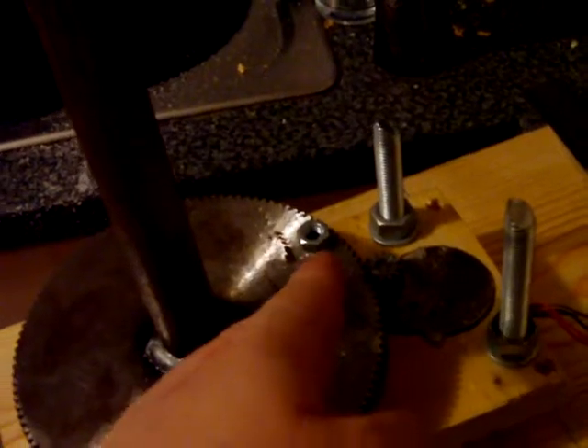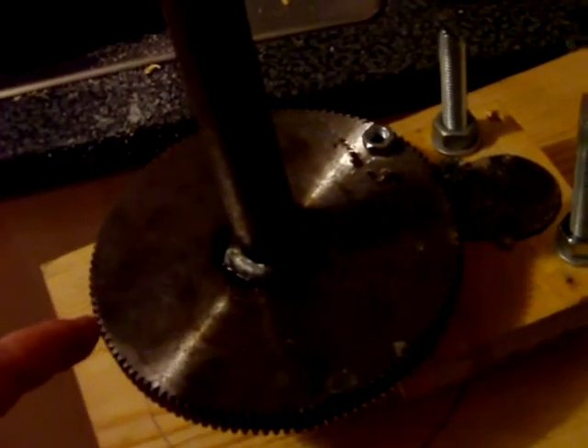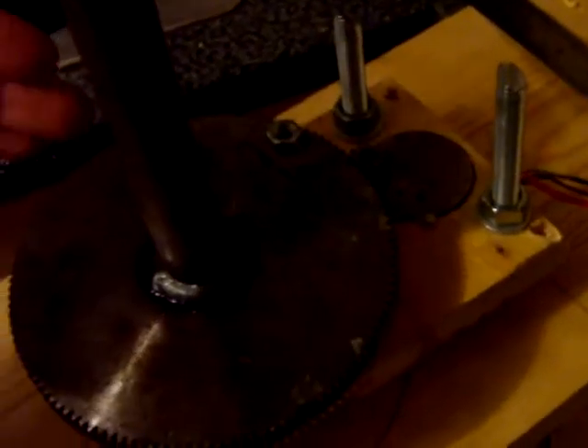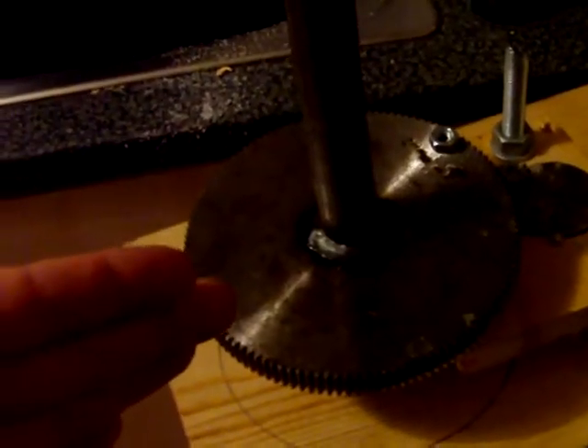It's only a very small motor — a very small stepper motor — using 5 volts, able to provide enough torque to hopefully withstand the wind. Now I've timed it. That bolt there, I've just put there as a marker. It takes 10 minutes for this giant wheel to go from here to here, which is easily enough time for this dish to track the sun as it moves across the sky.